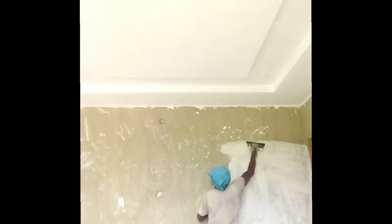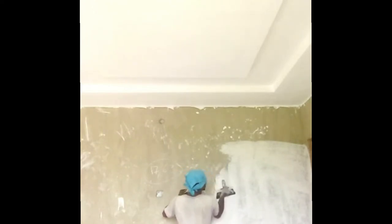What you need to do is to screed the essential places, the living room or parlor, whichever way you call it, and then your bedrooms. You screed it, you POP it. But the toilet and the kitchen, because you're going to tile them, they just rub it and prepare it, pre-ready for tiling, so the tiles grip properly. This is just to tell you how this is being made.